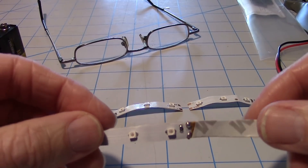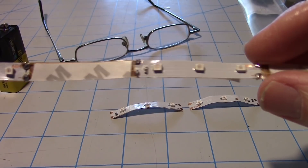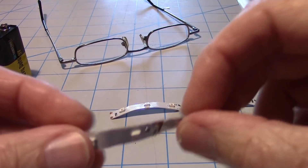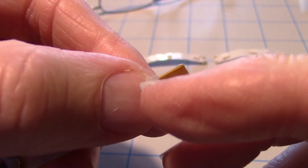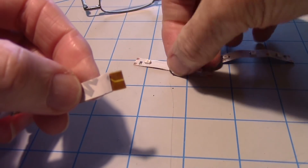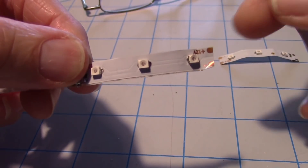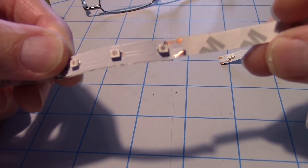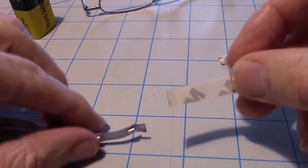I'm working on some LEDs to put along inside the fuselage in the tail. I'm soldering together groups of three LEDs — three going one way and three going the other, alternating like that. I just remove a little bit of the cardboard from each piece and stick them together back to back, then solder little wires around them. Make sure the voltages line up — 12 volts lines up with 12 volts, and ground lines up with ground.